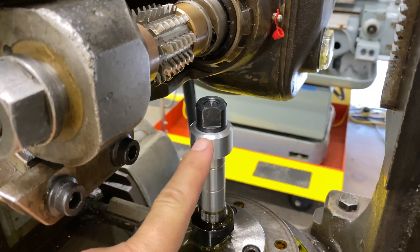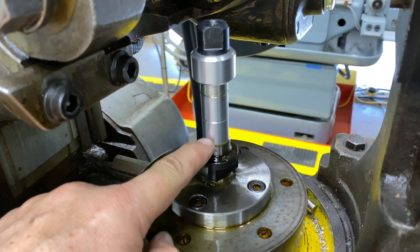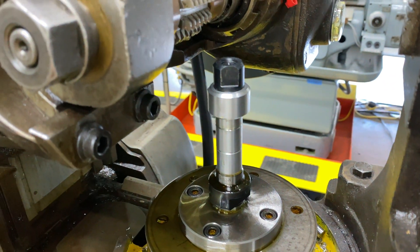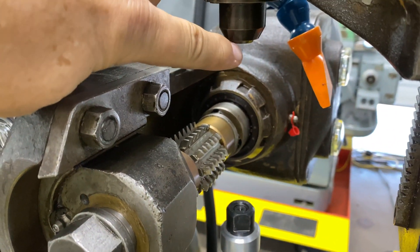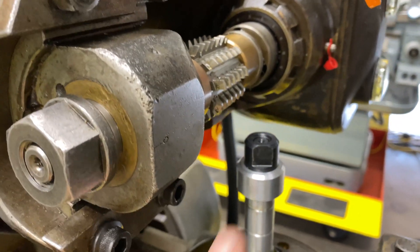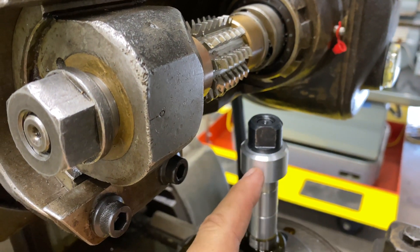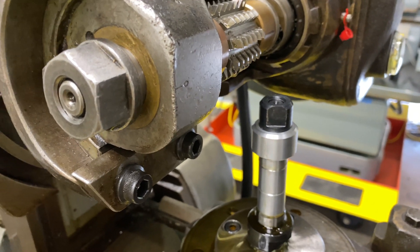The pinion is made just like the gear — this is the smaller one called a pinion, and it's mounted on this arbor here; these are just spacers to hold it up. In our tailstock we'll put a little center to hold this straight. This is our hob, and we'll cut the teeth — we'll climb hob the pinion right there.